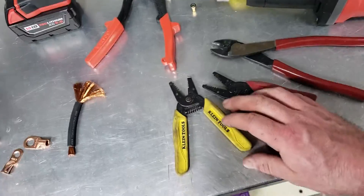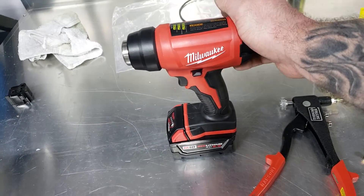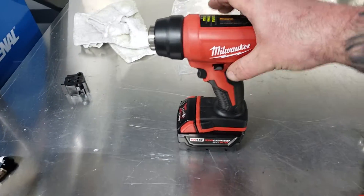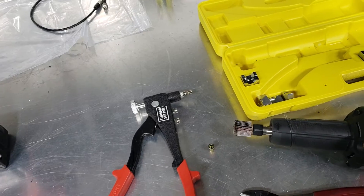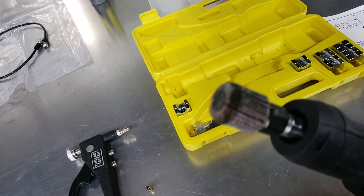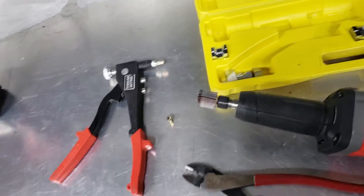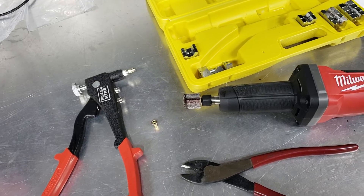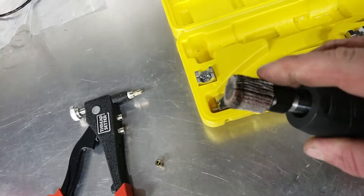Normal Klein wire strippers are the next thing. Also, some of the stuff that comes through me — you guys use torches to melt heat shrink. Use a heat gun, don't torch it. Another cool little tool I use a lot is just a die grinder — any brand will work — with these little sandpaper rolls. Almost everybody winds up painting or powder coating everything, and when you go to ground, you don't really have a very good contact. So knock the paint off with one of these.